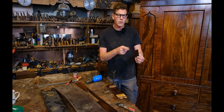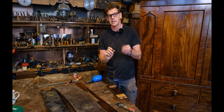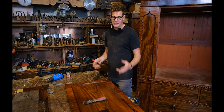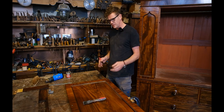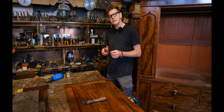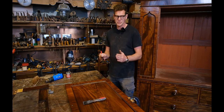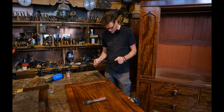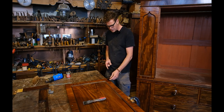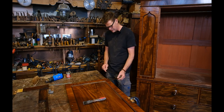The next stage is to take the door off and give a demonstration of how we prepare the area it's going to be glued to and how we prepare our patch. What we've got is a missing corner piece. As a rule, if you're going to patch a piece of veneer, get it as close as possible but ever so slightly oversized. Then you hold it into position, score down the edge of your veneer patch, and almost make the hole bigger to fit your patch - that way you'll get a much more accurate fit. I'll clean up this gap, cut an angle on my piece, oversize it by a millimeter, and then make it fit.